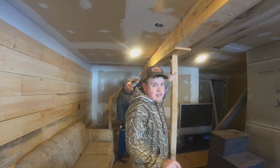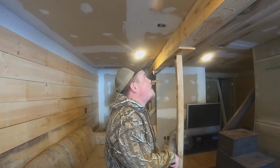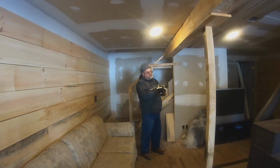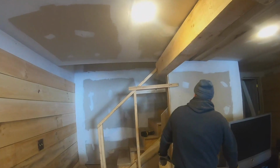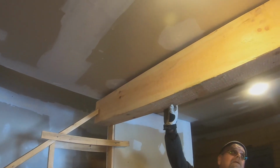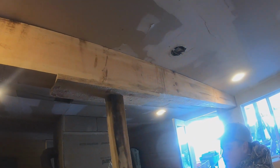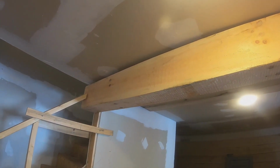Now, as I mentioned, guys, this is a settled house, so you can kind of, I don't know if you can hear it or not, but the floor has come popping up here a little bit. Over here. Yeah, come over here. You can see it a little better. You can see the gap we've got still, and we're tight here, but you can see the gap we've got, so that's what we've got to get out of it. All right, hold on to this so we can tweak it in further. Okay. Put a hammer and a block glue.